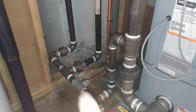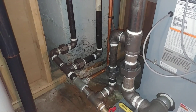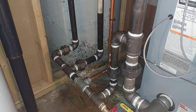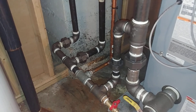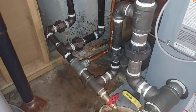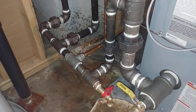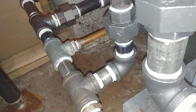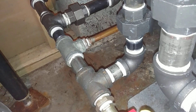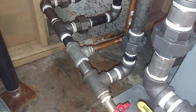I used all steel and had unions there because I suspected that was going to happen, so it was a relatively short delay — but in February when you're replacing a boiler, any delay is aggravating. I used stainless close nipples where it mattered. That leftover piece is from the gas pipe — it's galvanized — so when I took it out of service I put it to service there. The copper is going into a brass bushing, which helps reduce the corrosion levels.